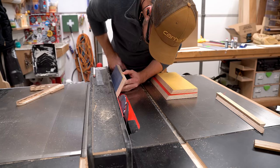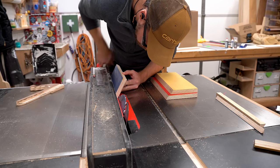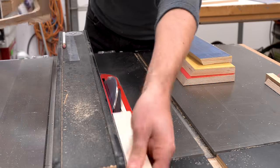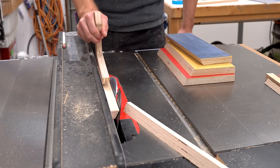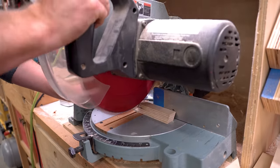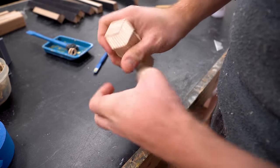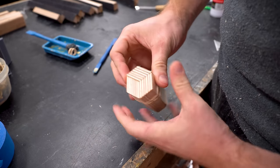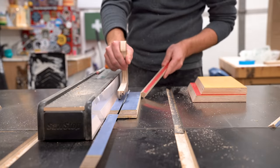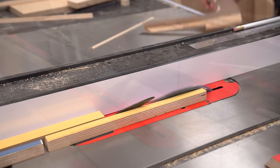Basically you want to set up with your 60-degree angle, rip one edge of your panel, and then use that panel to set the fence of your saw so that it's just touching those teeth when it rests flat against the bed of the saw. The hexes can be a little bit finicky, so before I cut my actual material I usually like to run a piece of scrap wood through the saw first and then cut that piece into three individual pieces so I can make a full hex pattern. I quickly check those using a rubber band. The main thing I'm looking for is to make sure the joint is nice and tight and closed with no edges sticking out on the sides. If the joints are a little open and you see a gap, that means the angle of your saw blade is wrong. If there are points sticking out on the sides, that means your fence is set incorrectly. Make those adjustments, dial it in, and once you're happy with it you can start cutting your strips.